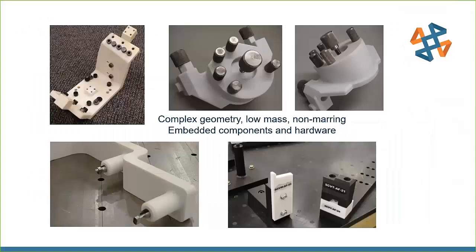Here's an example of metal inserts in plastic parts — things that would traditionally just be machined. When you need things like good threads, we can easily embed threaded inserts. It's something people have been doing with 3D printing for a long time but is still really underutilized. For low volume production fixtures and assembly fixtures that need to withstand threads or mating surfaces, just put in a press insert or a metal sleeve for a threaded insert. This is really only possible with FDM when it comes to plastics 3D printing.